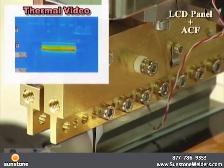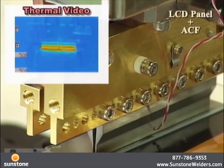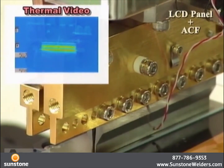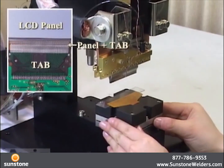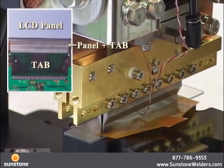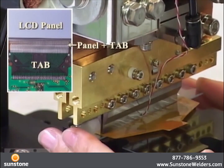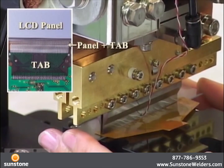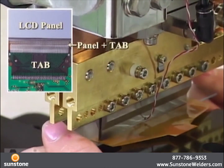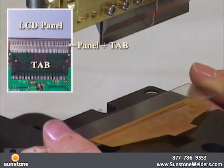Thermography provides a vehicle to see if the wide joining area is being heated and cooled uniformly. Furthermore, the tab is thermocompressed to complete the module assembly process. While control of temperature, time and pressure is important in thermocompression bonding, the pulse heat unit from Avio is superior in all these aspects, providing highly reliable bonding.